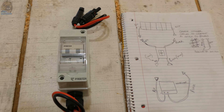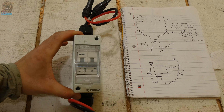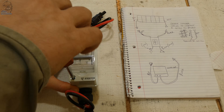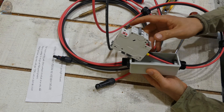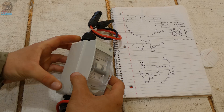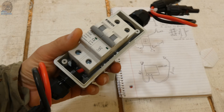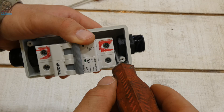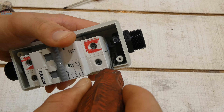For the PV disconnect switch, this 30 amp DC switch works like a breaker — turn it off anytime you need to work on the system. It does the job but the box is very tight inside. When I tried to use ferrules on the connections, they didn't fit. And to mount the box anywhere you actually have to take it apart. If I were to do it again, I'd get one with a bigger enclosure, ideally waterproof with compression fittings and a gasket seal. I mounted it under the solar panels for a bit more rain protection and replaced the short wires it came with with longer custom-made ones.